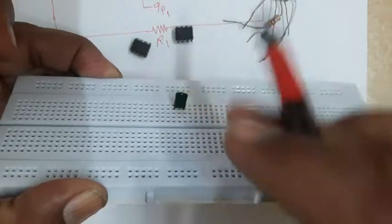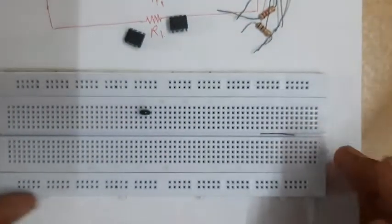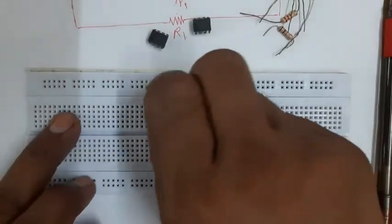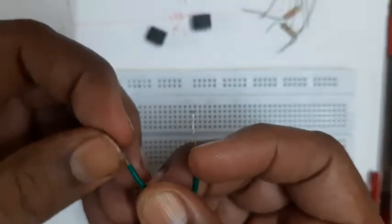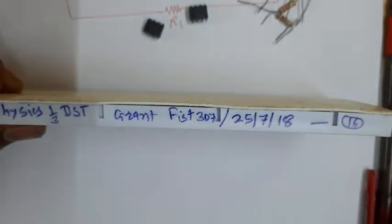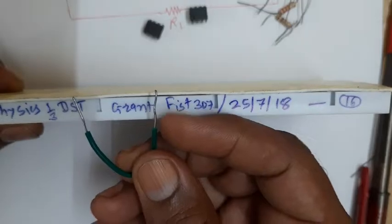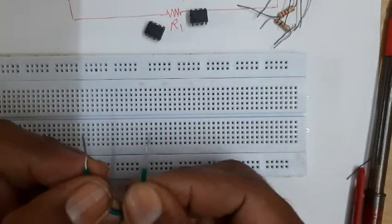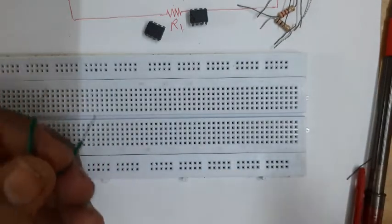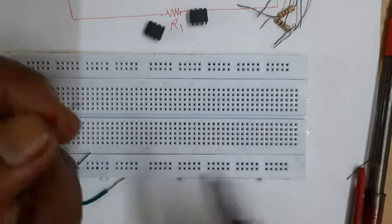When legs are cut very small, inserting the capacitor in adjacent holes means it sits just above the breadboard, so there will be no short circuit - no terminal will interact with any other terminal. For the wire, when I insert it, it should not touch the base of the breadboard. The length of the wire should be about five to six millimeters. If you are using fresh wire, you will have to strip it to a length of about six millimeters - it should not be very large.